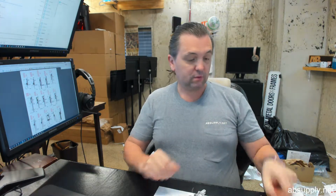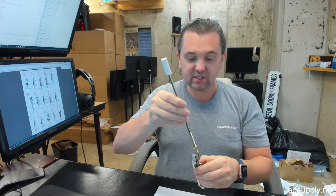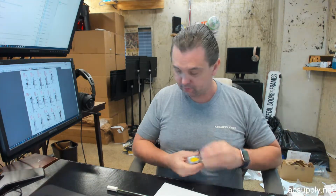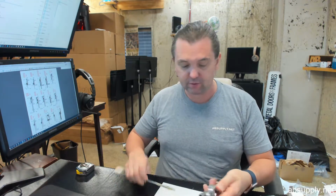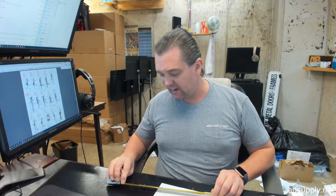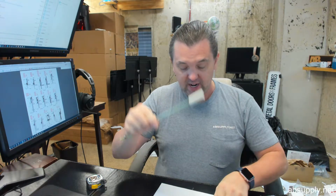It's a 12-inch bolt, and here is the bolt. It's going to have a nut, a threaded portion, and a plastic head. When they say 12-inch, what they're really referring to should be the top of the door, but let's take a look. It really isn't. I don't know how they're gauging this storefront material, but generally a flush bolt's overall length is the top or bottom of the door to the center of the faceplate. That's not how this one's working. The overall length of this is 10 and 9/16 from the top of the threaded head to the bottom of the threaded end.